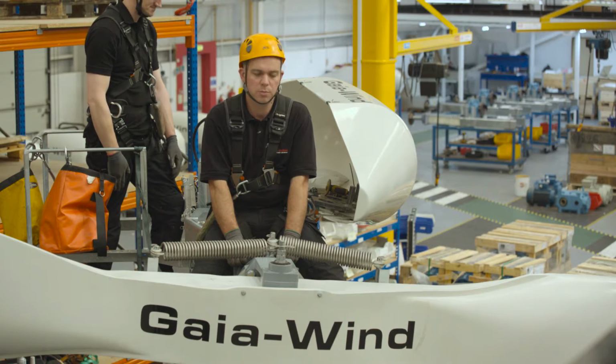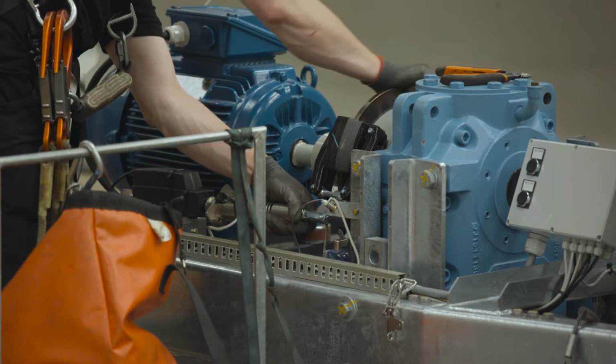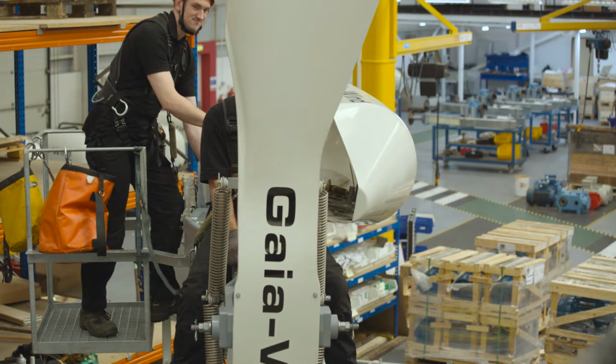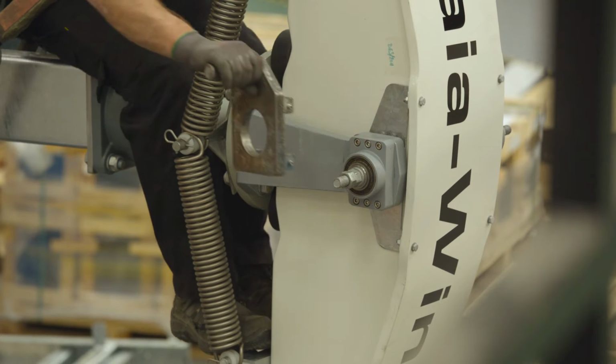Step 1, release brake and rotate blade until blade is vertical. If M16 rod has M8 tapped hole in the side, then make sure this is at the left-hand side. Step 2, we fit reaction arm brackets over both hub bushings each side of the blade.